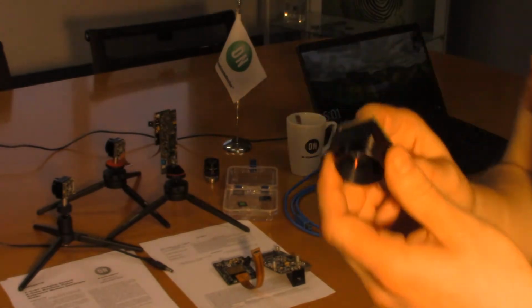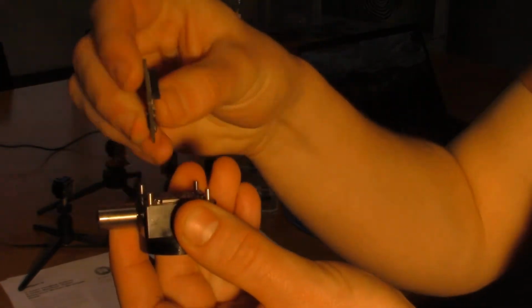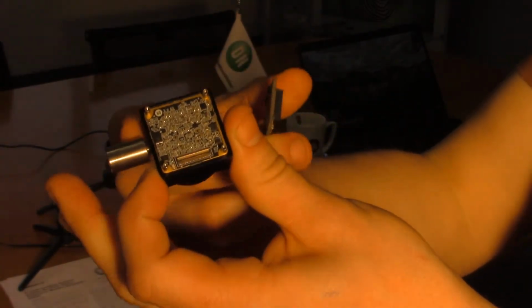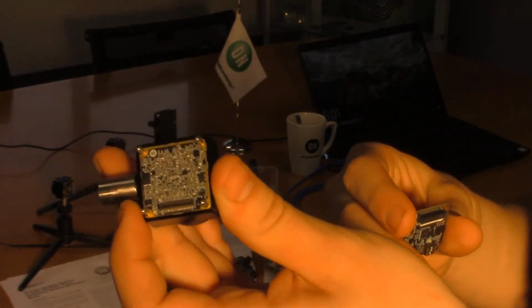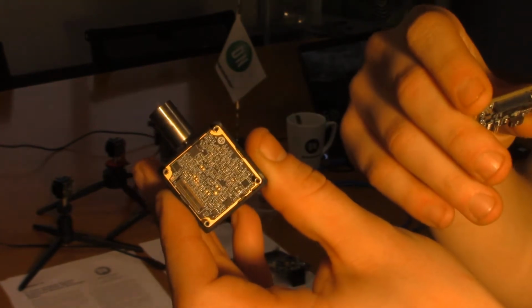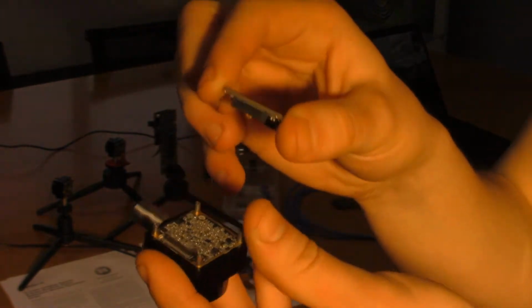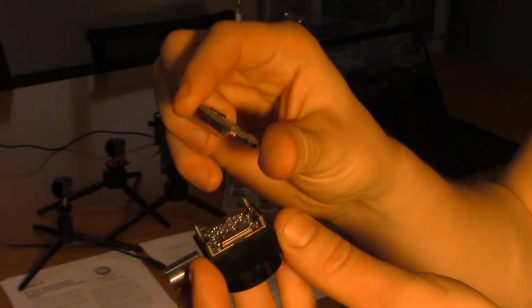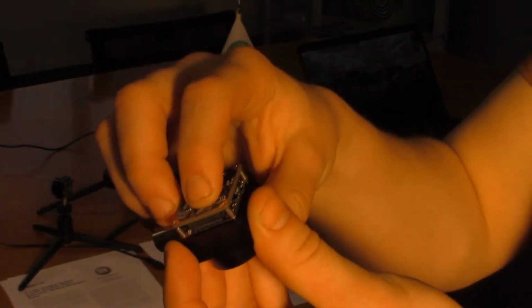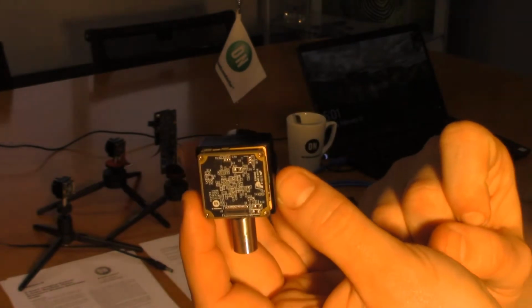When you receive these cubes, you'll see that they consist of two parts with a connector, and you can take them off. The back side of the sensor is our small reference design, which you can copy, and it's available under NDA on our image sensor portal. This outputs our HiSPi channels, which are coming from the sensors over this small connector here. And this HiSPi to MIPI converter board implements an Altera FPGA to convert 12 out of the 24 HiSPi channels into 4 MIPI data channels.